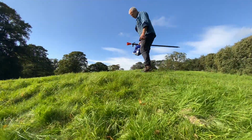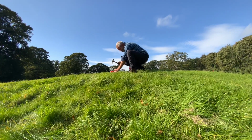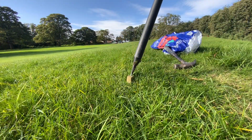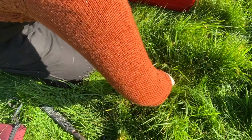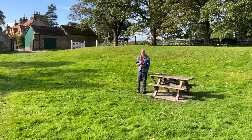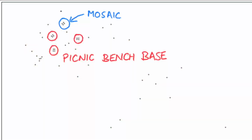You can also put in your own temporary markers at specific places that exactly suit your needs. Wooden pegs are an environmentally friendly option, but if you are working in fields where there are livestock, especially horses, be careful to hammer them flush with the surface to avoid broken ankles and the risk of prosecution. As the vegetation grows, your markers may eventually become difficult to see, but you should be able to relocate them, even several years later, by taking careful measurements from the plot of your control network.